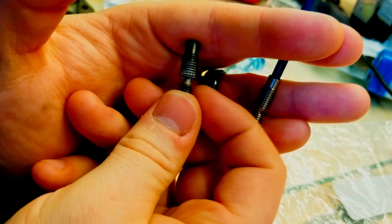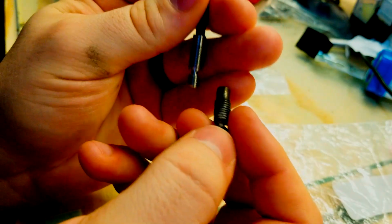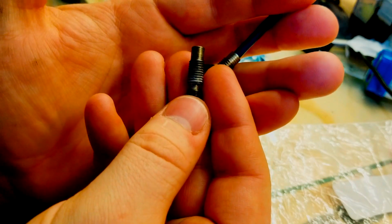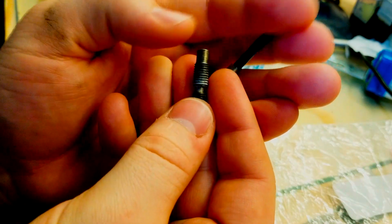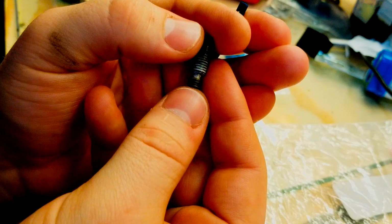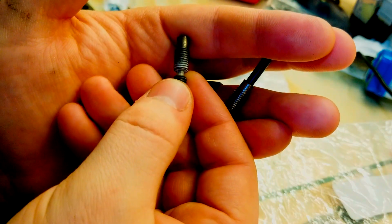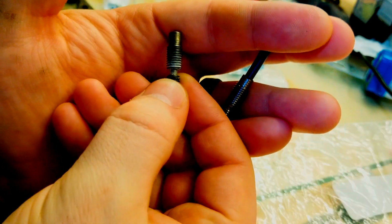It's a lot less risky to add in some wall thickness compared to this one, because that'll result in less broken parts. Same thing for the threads. If you can spare 5 seconds here and 5 seconds here turning it, that's less tooling, that's less time, and that's less effort that you get to do and ship the part out the door.